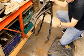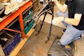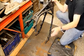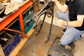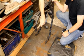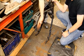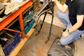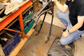Now, once we've got these two bends done on this tube bender, it seems the rest of the frame is going to be built from straight tubing. We don't have to worry about bending any more tubing, which is great, because again it makes life a lot simpler. Well, these might have to just be warmed. Actually what I can do is put a bar inside it and warm it and just gently get them flowing in. There'll be a bit of tweaking, but it's not something the tube bender will be able to do. It's going to have to be done by hand, once it's in the jig.